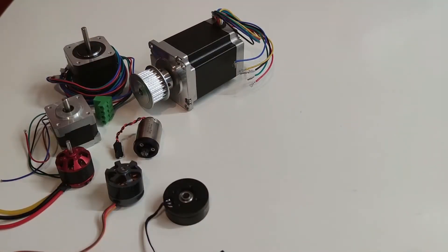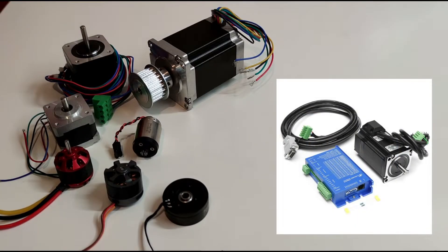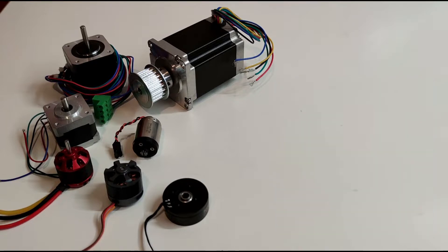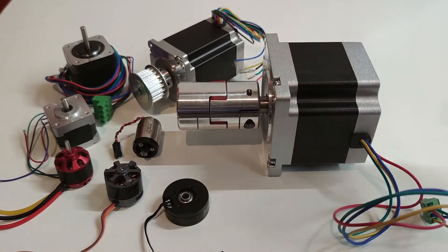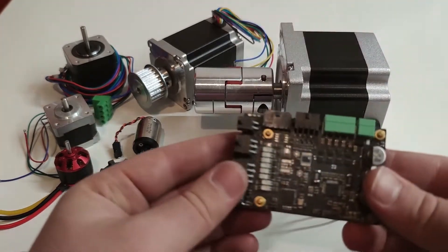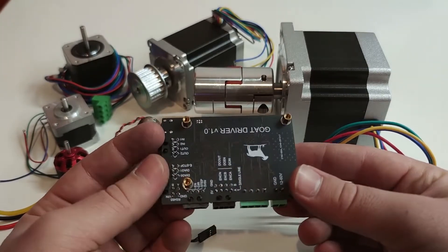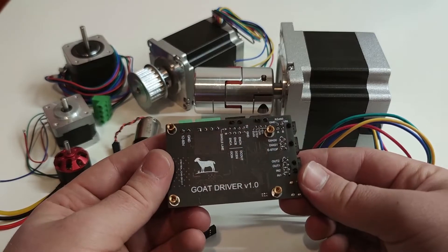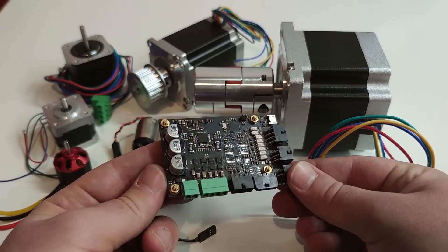For motors the decision was easy. Since the budget was low, I knew that servo motors were not an option. The closed loop steppers were the best option considering price-performance, but since I am an electrotechnical engineer I decided to spice things up a bit. I didn't want to buy the closed loop motor sets because I already designed a very nice stepper driver. It has a lot of options and is based on a Trinamic IC with my own periphery. If you are interested in that kind of topic, let me know in the comments and I can make a video about that.